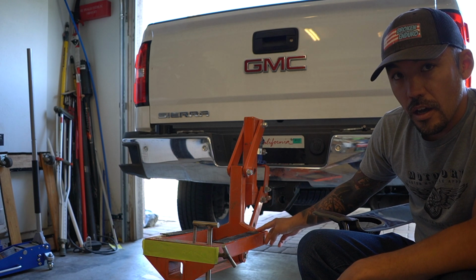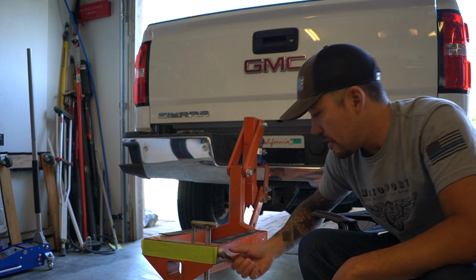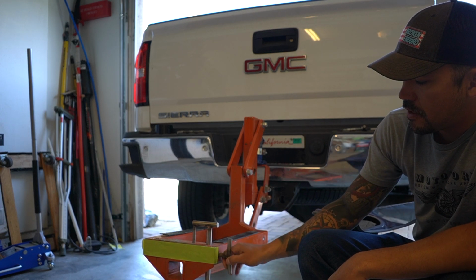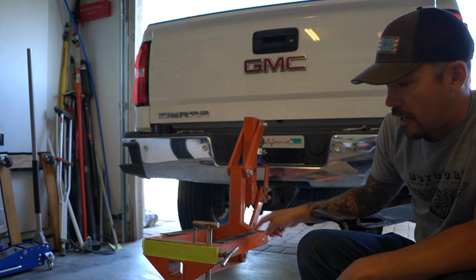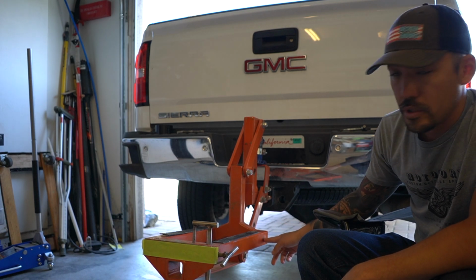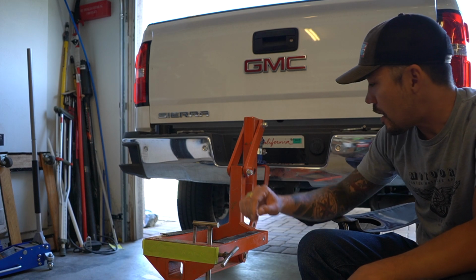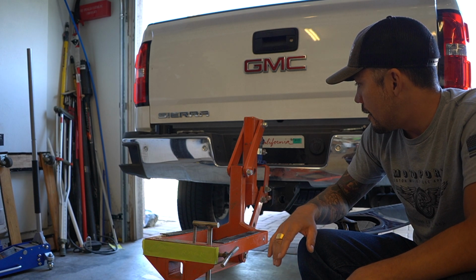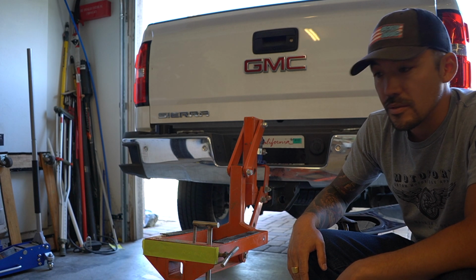But I had something happen with the front one, and there's a nut that's welded inside the frame that these little set screws work their way into. Something twisted in here and this bound up, and I ended up shearing off this other set screw back here. So short of drilling it out, retapping it, this whole thing is dead in the water. Yeah, so not super impressed with this.